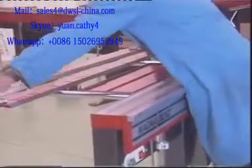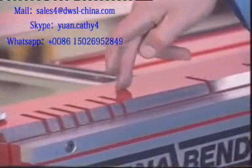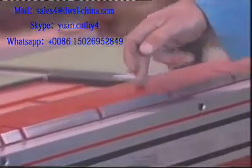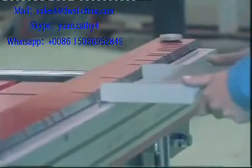An optional slotted clamp bar is available which makes the forming of trays and shallow boxes very efficient. The positions of the slots have been calculated so that all sizes of boxes and trays can be formed — the size you want will be found somewhere on this bar.